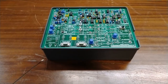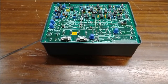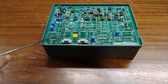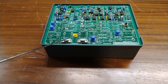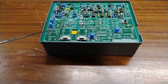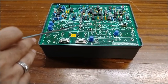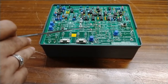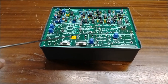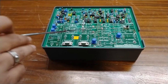In this trainer kit there are different blocks used to transmit, generate, and receive signals. We start with two fiber optic LEDs used in the transmitters — the peak wavelength of emission is 660 nanometers (red) for one transmitter, and 850 or 950 nanometers for the other. Similarly, there are two fiber optics detectors — receivers. The 660 nm receiver pairs with the 660 nm transmitter, and the 850/950 nm receiver pairs with the 850/950 nm transmitter, both with SMA connectors.